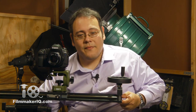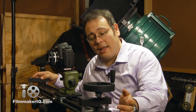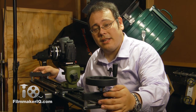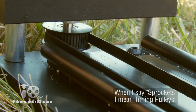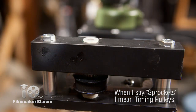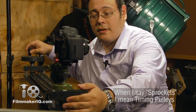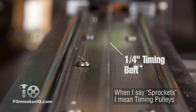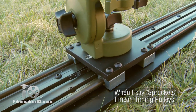The first thing I did was I raised the end bars here — I don't know if you can see that — and added one inch aluminum spacers to give myself enough space for these little sprocket gears here. This sprocket gear here is connected to this wheel, which is our power drive. This sprocket gear is just free floating, just sits there, just spins. Between the sprockets we have a quarter inch timing belt that is connected to the sled via a couple of screws that I installed in the sled itself.